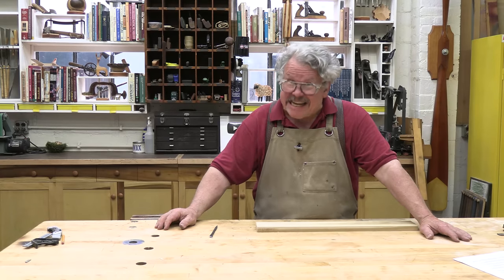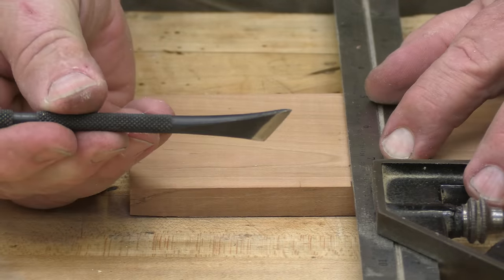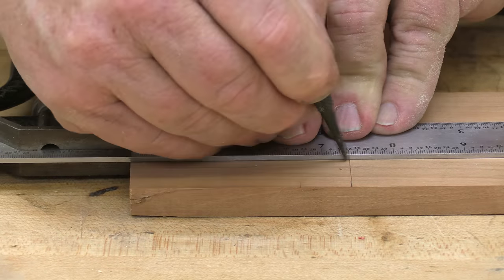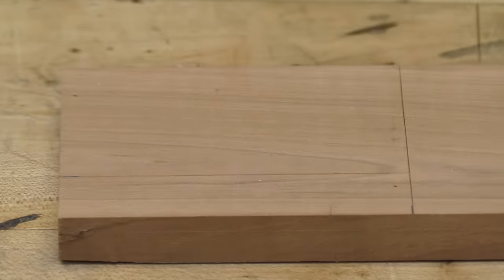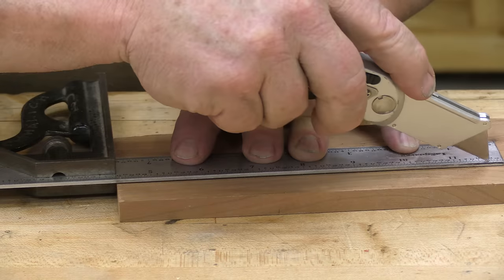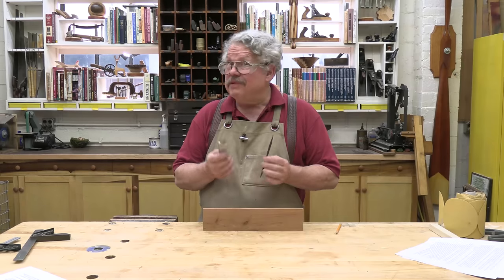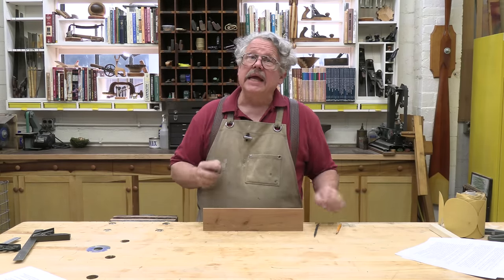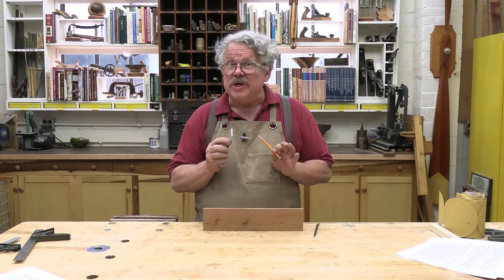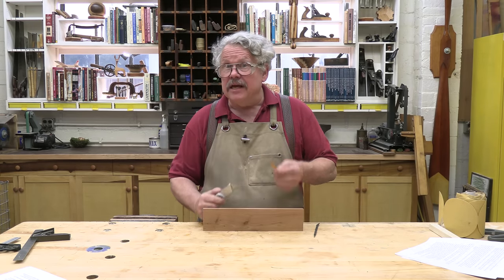The best way to create a precise line on a wood surface is to score it. The standard woodworking wisdom is to use the knife to score across the grain, then turn it over and use the point to score parallel to the grain. The point is less likely to follow the grain pattern than the knife. However, you can also use a knife parallel to the grain as long as you don't press too hard and keep it firmly against a metal straight edge. Mark the score in several light strokes, not one heavy pass. A scored line made with a metal tool is narrower and far more consistent than one made with a pencil. Furthermore, it's far easier to transfer a scored line precisely than a marked line.